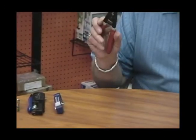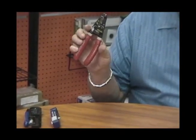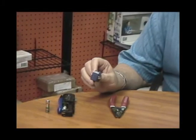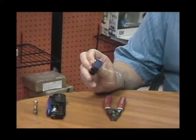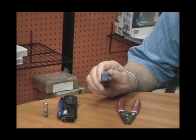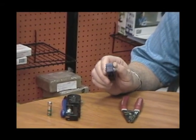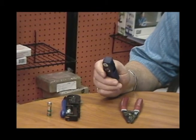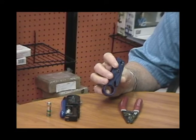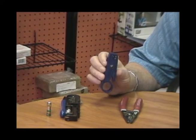First, make sure you assemble the right tools. I'd recommend a good multi cable cutter tool like this Klein part number 63020, and a good strip tool like the ICM PSA 59-6. This particular tool does RG59, RG6, and RG6 quad shield. It comes with an extra set of cutters and has a tool for cleaning out your RG6 center connector.